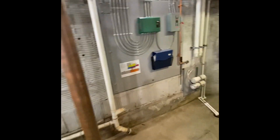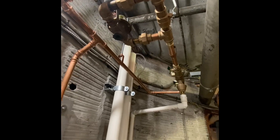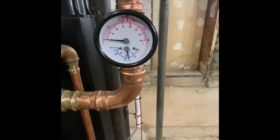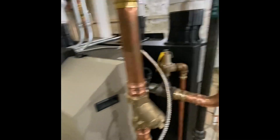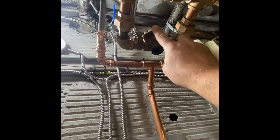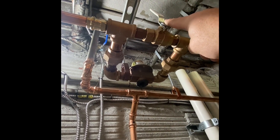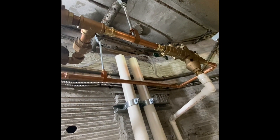We have the water feed. We're running this system at about 25 PSI — we're about 30 PSI here at the gauge. This is a four-story building and we've got 50 pound relief valves. We've got a three-quarter inch fill with unions on each side so it can be easily replaced, a manual bypass, and an RPZ to protect the potable water.